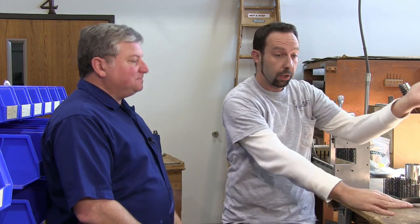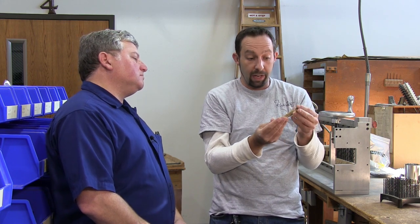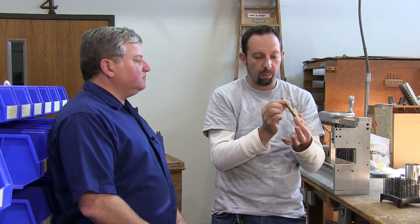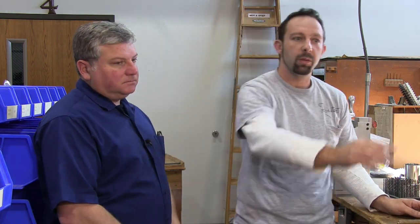We determine, and we have a schedule, what our shallots are going to be. And these are oboe shallots. They start out as blanks, just a piece of brass, and then we take them over, we have a press over there that forms them to this point. And then we have to use a series of mandrels, which are actually back there.